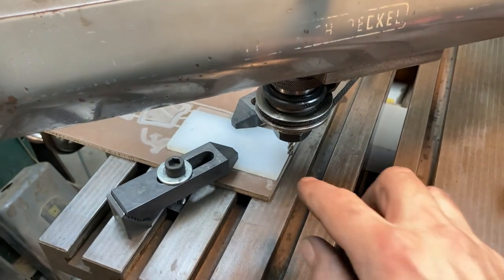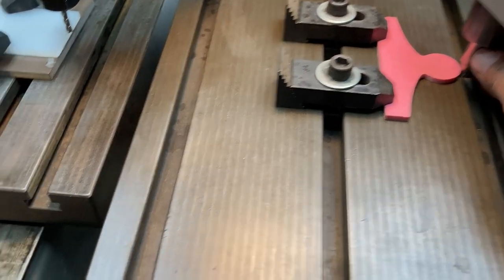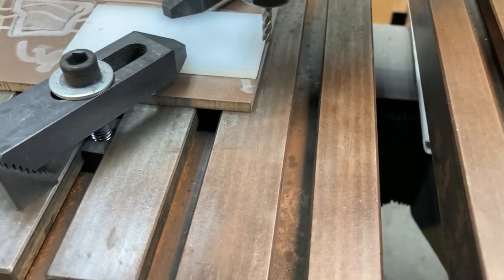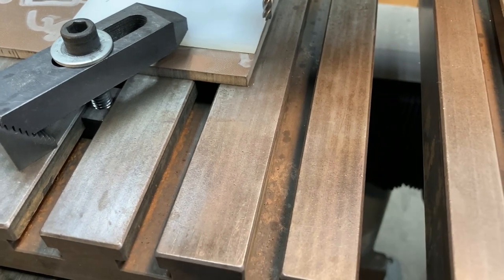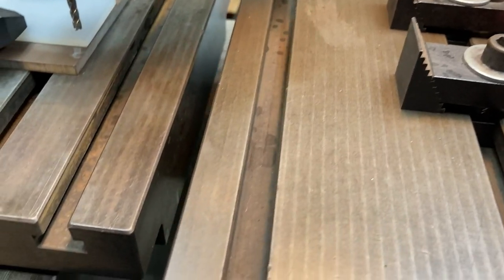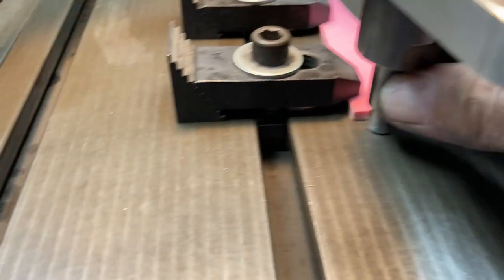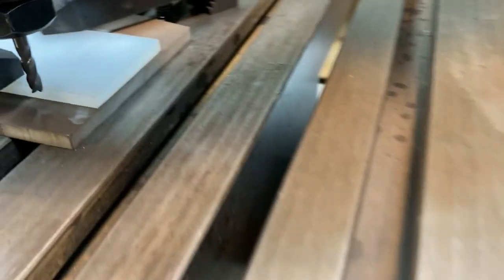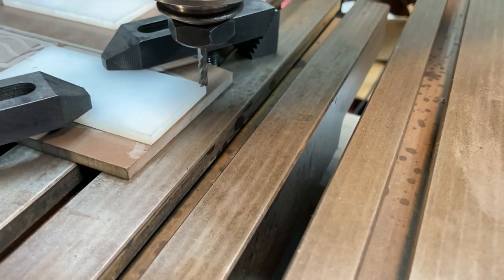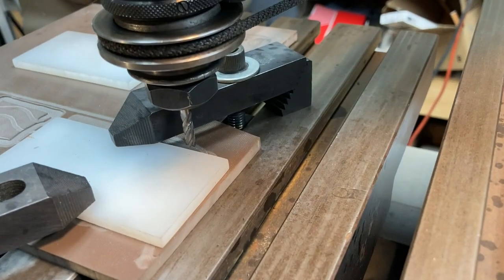With everything at 2-to-1, I've made sure that with the stylus touching the leading edge here, we are just contacting the leading edge of our tryout material. It's just 3/16 plexi. And then we've come and spotted in this edge. When I'm tracing this edge of this pattern, I'm just on the edge of that material, and also all the way around. There, we're just on the edge of that.